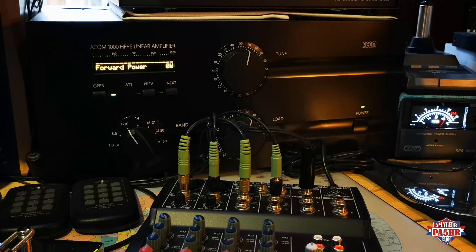You can input power between 10 to 20 watts up to a maximum of 75 watts, and then you will have maximum output power of between 900 and 1000 watts. Thank you very much for watching my video. This was a clip about the ARCOM 1000. I hope I can help someone with this amp. 73 and all the best from Papa Alpha 5 Hotel Romeo. This was a clip about the power amp from ARCOM, the ARCOM 1000. Hope to meet you on the frequencies — bye!